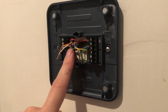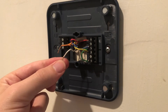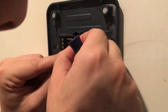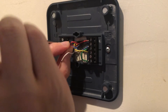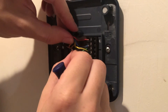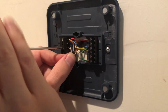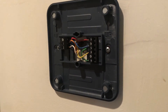It's got W and W2, but we're actually not using that because we have a heat pump. So we have the orange and the white, which go to OB and AUX. The orange is for the standard heat pump; white is for the emergency heat — or E — which was on the old one. So we're going to use OB and AUX here. Okay, it's all wired up.